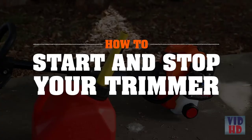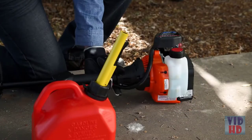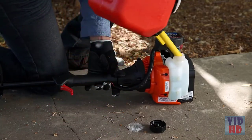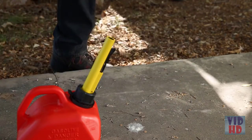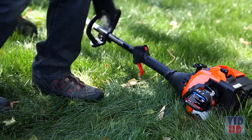To make your yard look amazing, you have to start somewhere — outside makes the most sense. Before starting, fill the tank with the right mixture of gasoline and oil. Check your manual to make sure you get the recipe right. Once you're filled up, move to a different area before starting in case any fuel spilled. You'll want to be sure to keep children and pets back at least 50 feet, too.